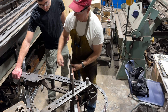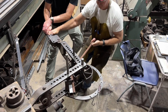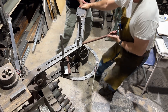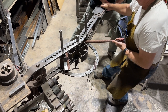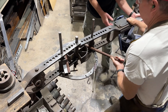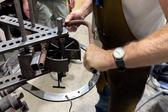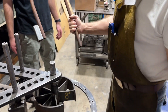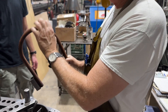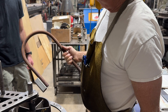I'm just going to gently pull with a nice steady pull and go right around — keep going, all the way around. I think I had a stop lock on here as well. That's a pretty nice bend. I don't think we had any deformation in the circularity of the pipe, so I'm pretty happy with that.